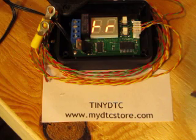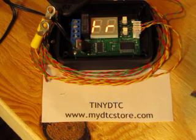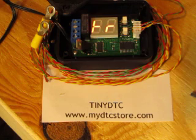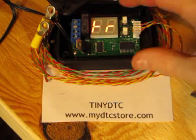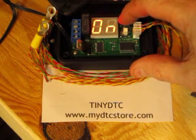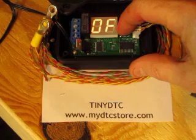It also has a timer mode, which is like a cycle timer. You can set an on time and an off time value. For the on time, it'll turn the relay on for that period, followed by turning it off for the off timer period, and this just repeats over and over. This is good for circulating pumps or a hot water system where you like to keep the water warm in the pipe. It also supports forcing the output on if you want to check your output, and disabling it if you want to work on it without worrying about it turning on.